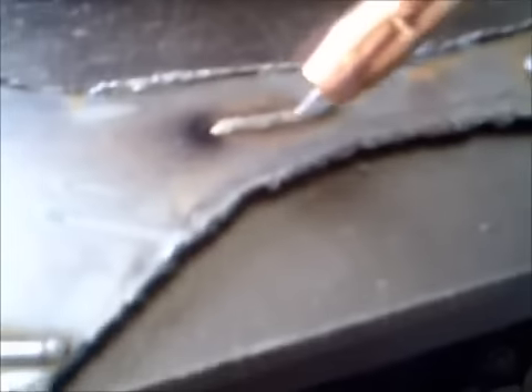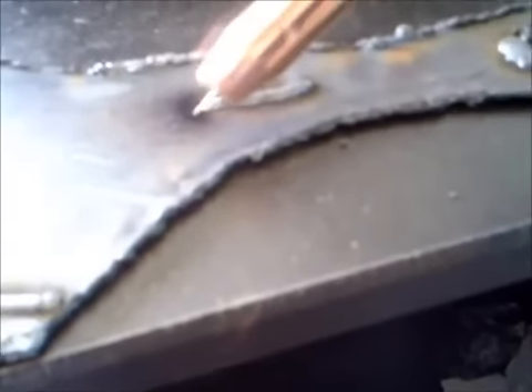That's the way this welder works. This was done on manual mode, not on the auto-set mode. When I welded, I did small circles. You can either do circles, or some people do C's and go back and forth like a wave. It takes a lot of practice to get a good bead, but welding with a MIG is pretty easy. I'm going to do one more bead — this one's just going to be in a straight line.